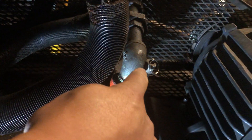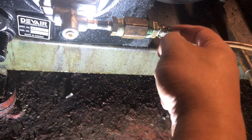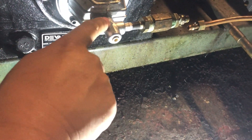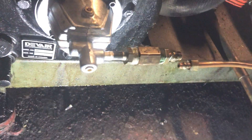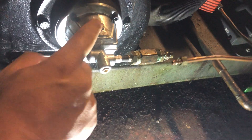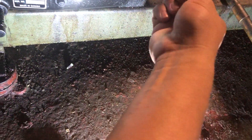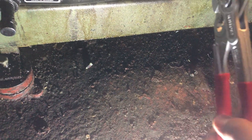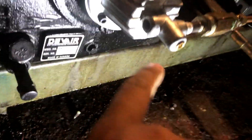That line should go into the tank. If this is running and you're blowing at the green spot right here, give it a test. If you've got no air coming out of here, then that means this valve is not opening inside — it's not sending pressure down that line to open it up. So your problem is always this component here. Now, if this is working, you'll see when the other pump unloads — when it finishes running and is satisfied — it releases pressure on this hole.